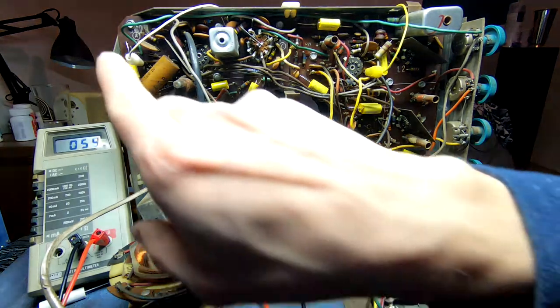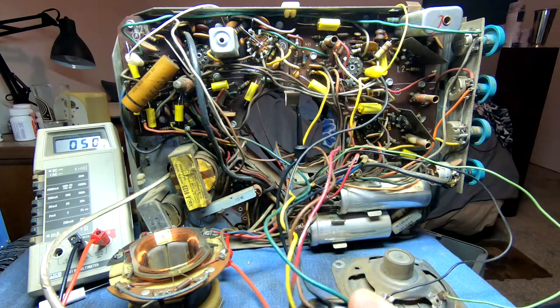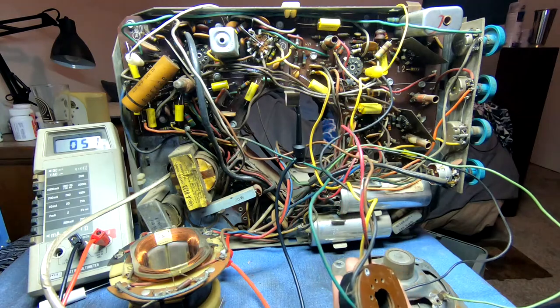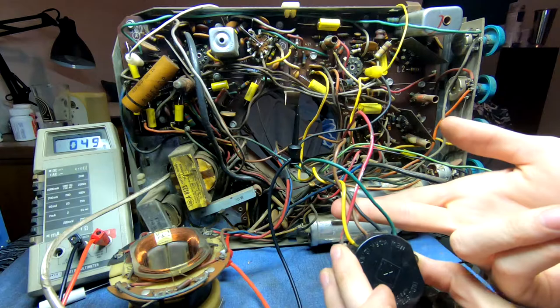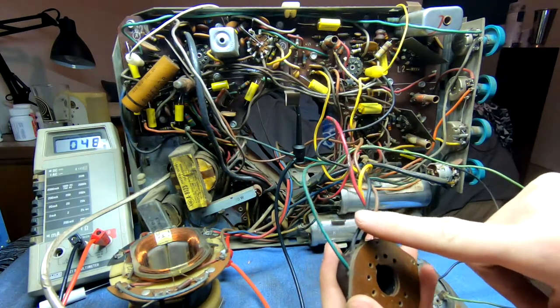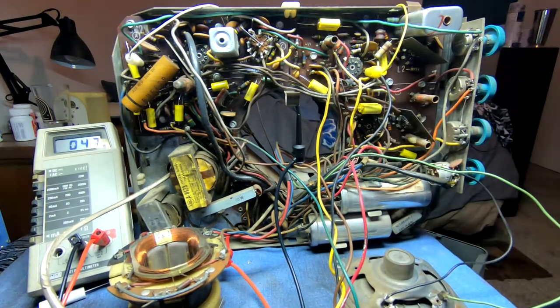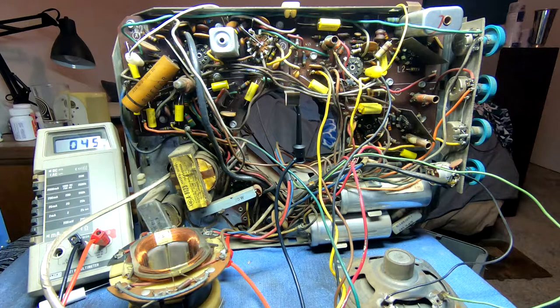So I've got these two alligator clips here. The CRT socket. This particular picture tube uses pins 1 and 12 as the filament, which are right next to each other, conveniently. And they are actually the red and black wires at the very bottom of this socket. The black wire goes over here to that pin, and the red wire goes over into the vertical circuit just up here near this tube socket. Now, we should get that going.